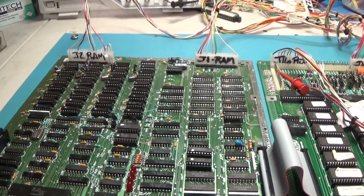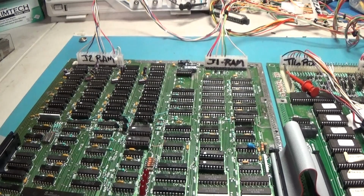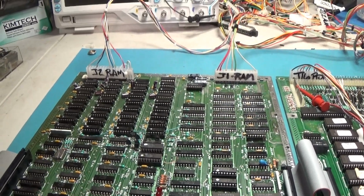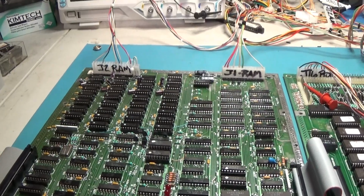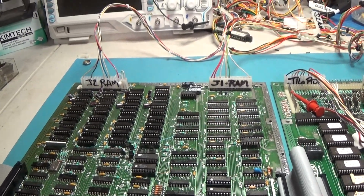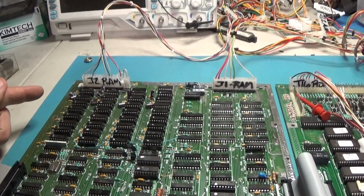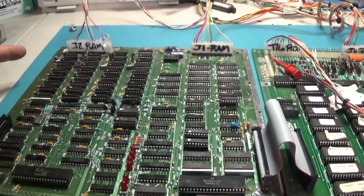It's kind of best practice, whenever you have tantalums that are filtering a power rail, especially like a 12-volt rail or whatever, because they just blow up. Filtering a 12-volt rail with a 16-volt tantalum, they are very suspect to blow up.